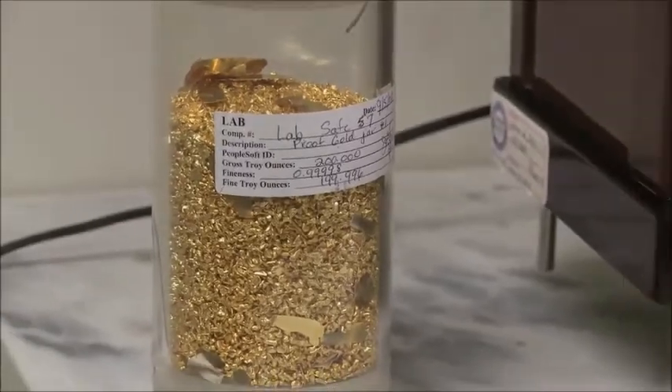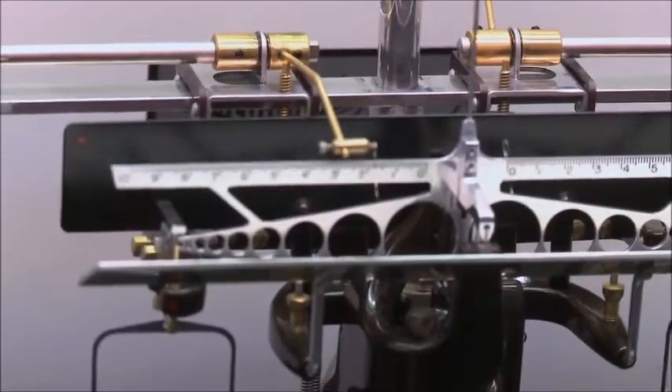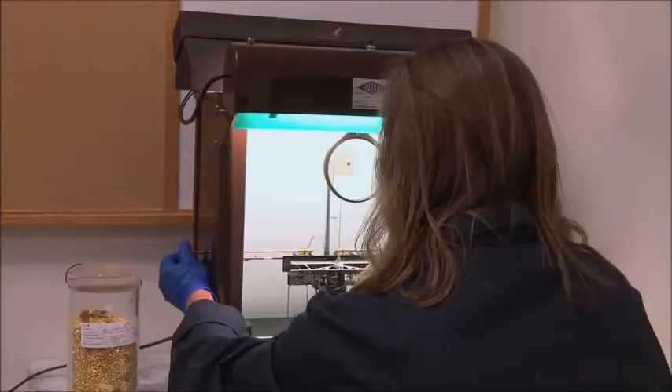We produce a lot of silver and gold bullion at West Point every year, and each one of those coins goes through a quality control check that Jeanette's team runs to ensure and guarantee to the American public and the world that the gold is four-nines gold and that the silver is three-nines silver. An assayer is basically telling you the composition of the metal. It's my job to make sure that when we say a coin is 24-karat gold, it's 24-karat gold; 22-karat gold, it's 22-karat gold. It's important because we're certifying to the American public that the coins they buy from the government are the purity that we say they are. We do guarantee the weight of the metal in troy ounces and the alloy composition.